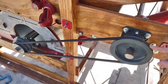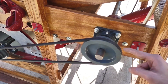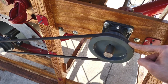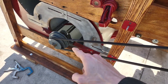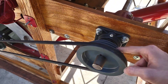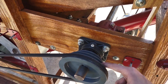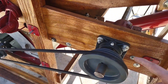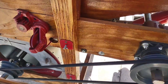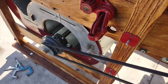This is the drive end for the bottom blast fan. The way a ratio works is: if it's on the larger diameter part of the pulley on the drive end and the smaller on the other end, it will be turning faster. The middle speed is one-to-one, which means the fan will be turning the same RPM as the eccentric drive shaft. And the smaller-to-bigger configuration slows the bottom blast fan down.